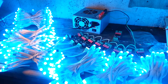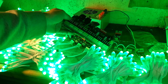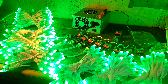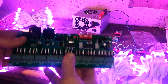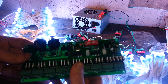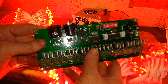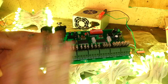While I have you here, I want to point out there's also this option from Ray — the 27-channel controller. It operates exactly the same as these little guys here, and they look very similar. The only difference is these controllers here have a maximum of two amps per channel, so that's quite a few more nodes. This smaller one is only 15 amps per board total, one amp per channel maximum. So you can do a whole lot more dumb nodes with the 27-channel controller. Or you can do fewer — maybe a nine-channel arch section. I use this for my mega arch, where each channel had about 20 to 40 RGBs per channel, and I used six of them plus the other three channels for something else.